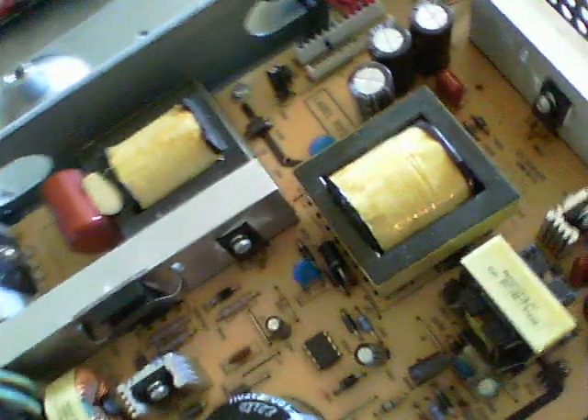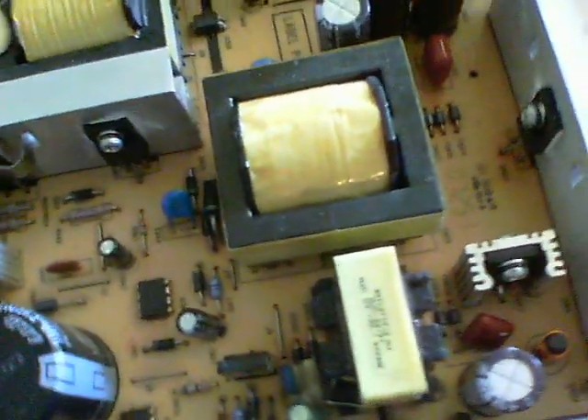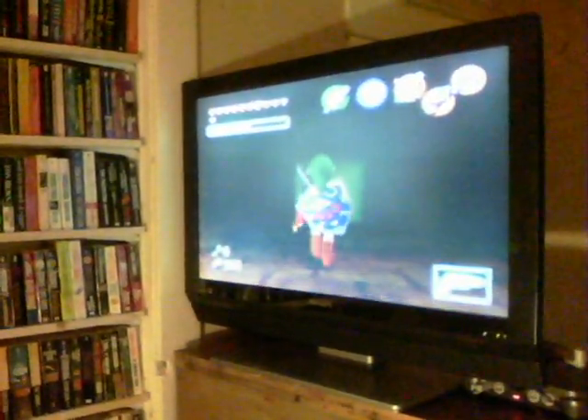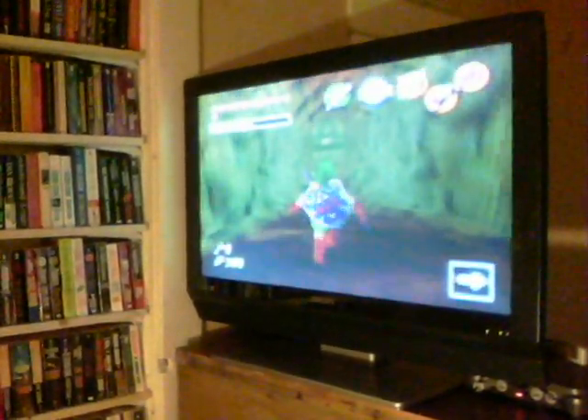Just to end with it, I'll show what I've replaced. Here's that large transformer. There's the big diode there — it's now got an FUF 5407 on it, and that's brought it back to life. So in summary, we've changed a few capacitors on the power board and a couple of capacitors on the main logic board. There we are, all back together with the stand and the speakers on it, and it's in service.